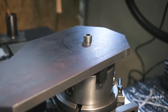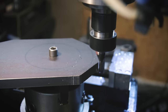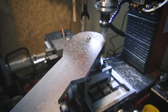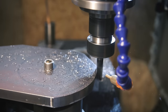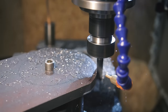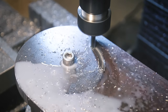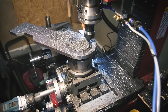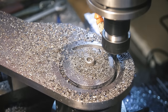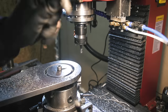I can now spin this around and side-mill the outside edge. I was kind of afraid to overshoot this cut on the bandsaw, so there's a lot of material left to remove, which is why I'm using my power drill to help out a bit. To remove this circle I'm cutting a slot again, but if I cut all the way through, at the very end the outside part would just drop down - which is pretty risky. You don't want parts coming loose on the mill, so my solution is to leave just two little tabs at the very bottom that are strong enough to keep it in one piece but small enough to be easily removed.